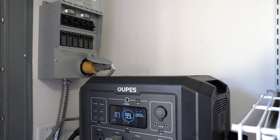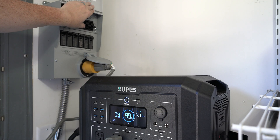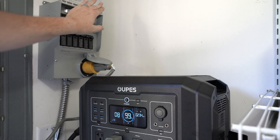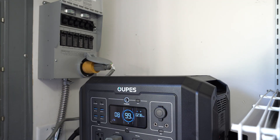I don't have my very large television on. Somebody may have turned it on because now it is cranking up — when I really pull that big TV, it's a very old LCD screen and so it pulls a lot of power. Here's the master bedroom — we have clocks and a ceiling fan running right now, so not a huge amount of power draw. So far with three circuits on, I could go ahead and do four circuits on — I'm only pulling 240 watts. Bathroom again has very little power draw because there's nothing really happening; if someone was blow drying their hair we'd see a much bigger power draw.